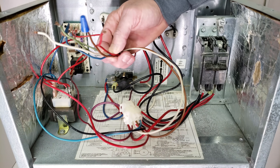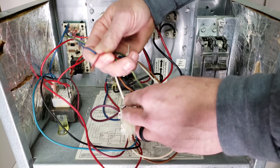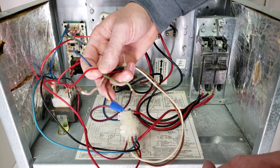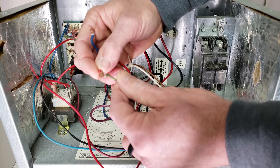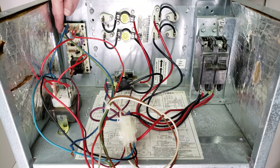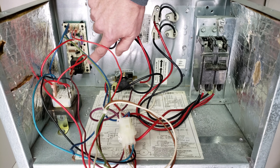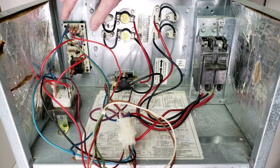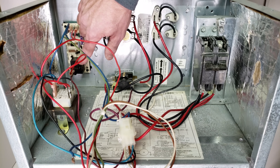You have your low-voltage thermostat wires right here. If you're trying to power a digital thermostat, you can apply 24 volts to it right here, and then you have your path back, which is the common. Now, when you're trying to turn your fan on, what happens inside the thermostat is that R and G touch, and so you have 24 volts coming from the green wire over to the control board on the G terminal. When that happens, the control board waits about 7 seconds before activating this relay.